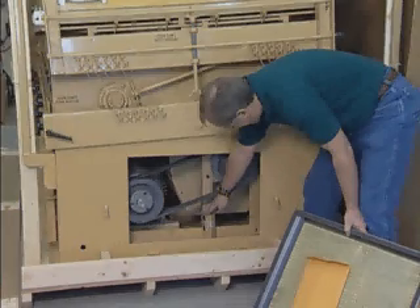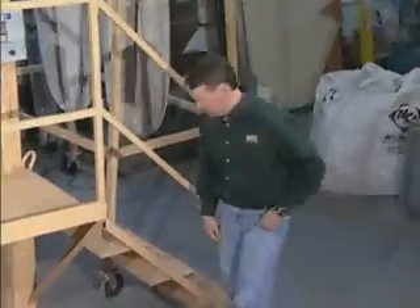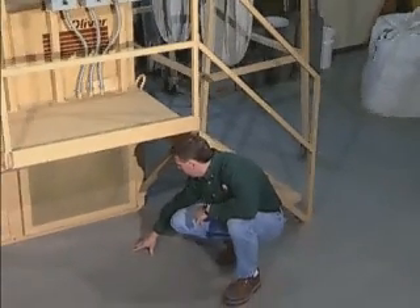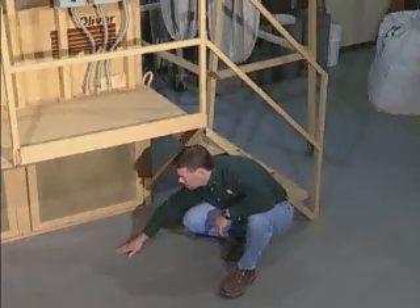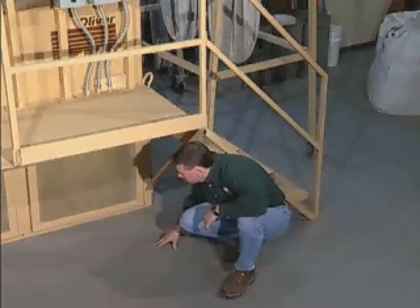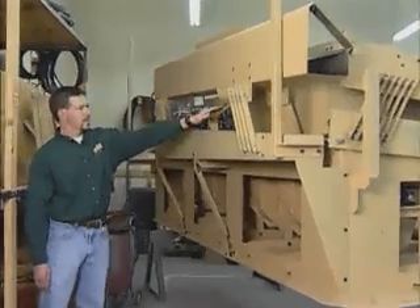Normally, they are held with wire ties. A solid level foundation is required for your Oliver. False vibrations from improper installation can ruin the separation efficiency of your machine. A 6-inch concrete slab is recommended but not essential. If you feel your floor is insecure, please contact the factory for recommendations.